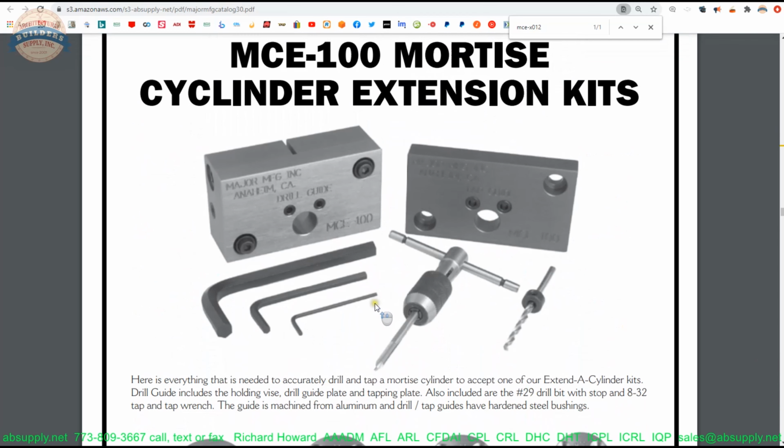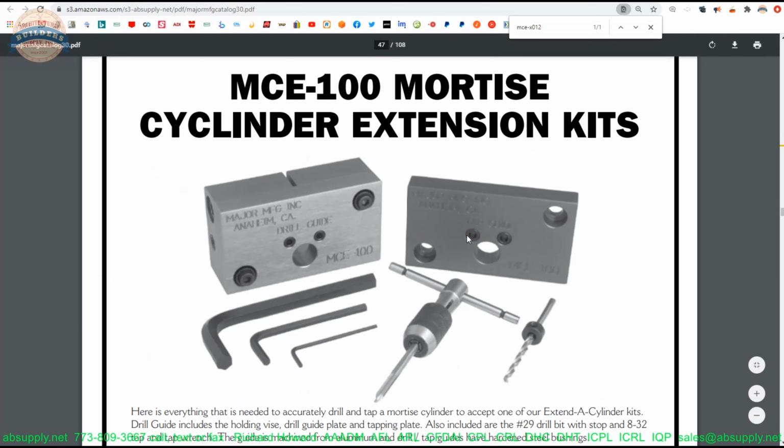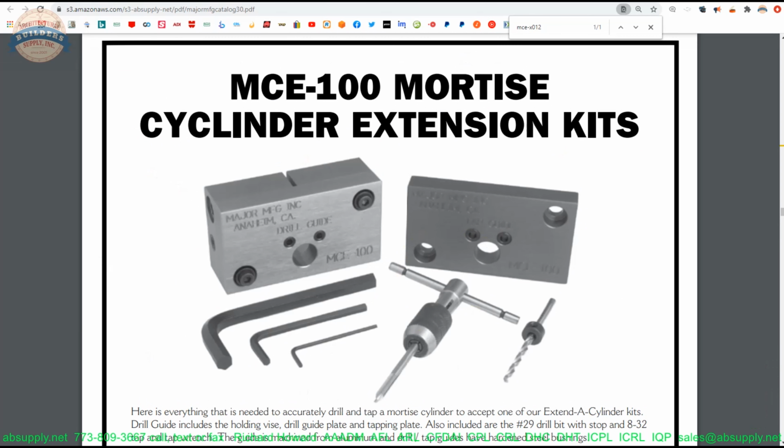And so you either will use this installation aid, or you won't. And if you don't, and I don't believe that you have to have it, however, freehand drilling this is not advised. You can certainly make your own fixture, I suppose, but I can tell you from actual experience, the precise placement of the holes is required. And while I did need to learn the personality of my fixture to make sure to get it placed so that I was pointing that drill at the proper position, that is really crucial.